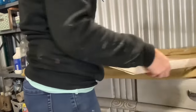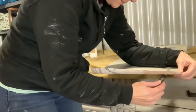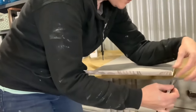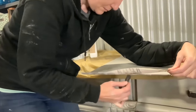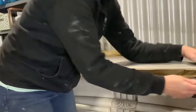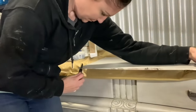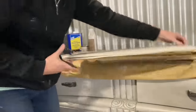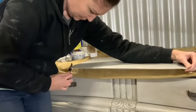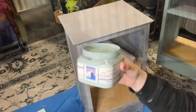Now that the primer on the bodies is drying, this was dry enough to go through and cut the papers off. I take my blade and run it along the edge of the backer board at almost a 45-degree angle to prevent any lifting around the edges, because you don't want your paper hanging too much off the edge. On backer boards it's not terribly important, but on some pieces like drawers you want a super clean edge so they don't hit and bump.